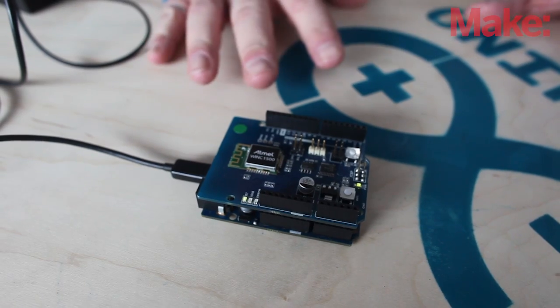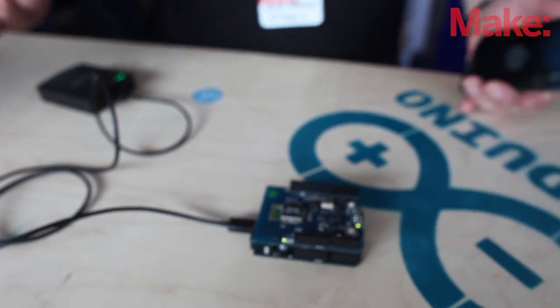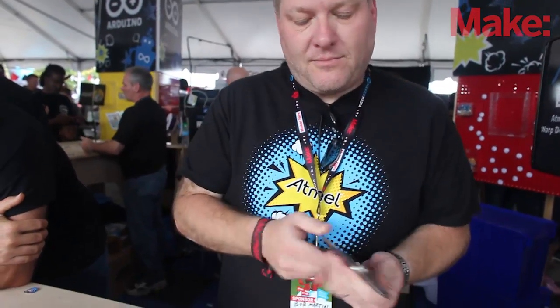So now we have an Arduino shield hooked up to the cloud. The second part of the equation is: it's one thing to detect an alarm, but we want to know what the alarm is doing. So here's our handy-dandy smartphone. We picked a cloud service called NotifyMyAndroid. You sign up and log in like Gmail or something like that, and after you've logged in, you generate a specific set of security keys right off their website. I took those security keys and compiled them directly into the software running on the Arduino Wi-Fi shield combination, which means that board we just powered up is uniquely identified to my login ID on the NMA website.